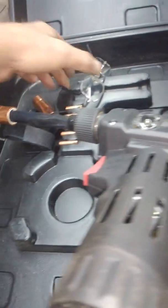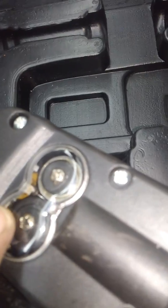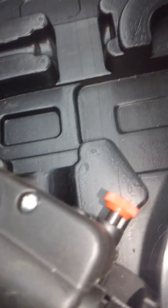It took a few tries but we got everything figured out on this spool gun. There's a knob on the top right, and you can see the drive rollers down in there. Get your wire started with the cap off before you set the spool down in there. If you squeeze together real hard and push down, that releases the drive rollers. It took a couple stabs to get the wire bent right.